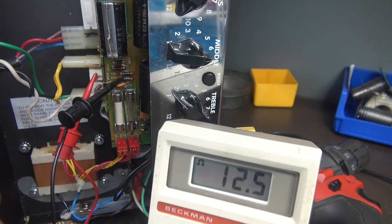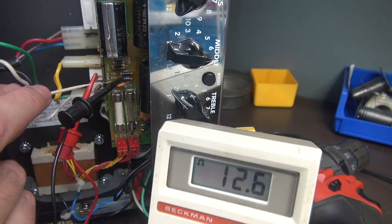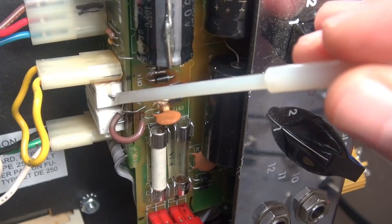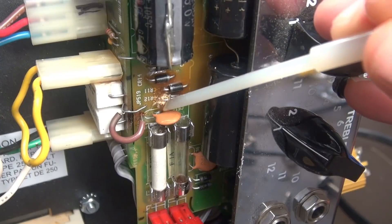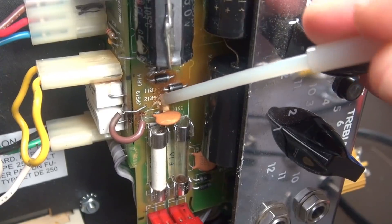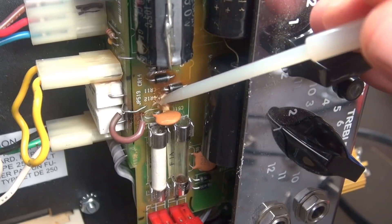So what's the best way to fix it? You might say, well, maybe you should just re-solder the connection — nope. What I'm going to do is run a hard jumper from that resistor over to that diode on top of the board. That would be a much more robust way of fixing that connection than this little crappy jumper. Here's a close-up: there's a little jumper that's loose, feeds these resistors, and it's going to a foil that is connected to this diode. You can see all this adhesive that they put in there to make this a pain. So I'm going to have to dig out the adhesive, then clean this lead real well, throw some rosin on it, and put a nice jumper from there to there. That should solve it.